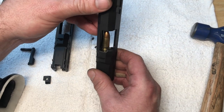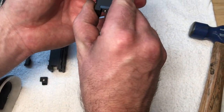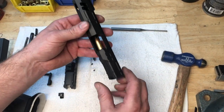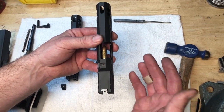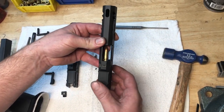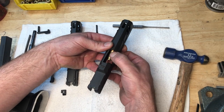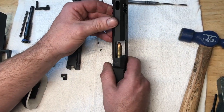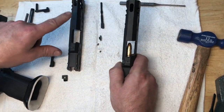I'm going to hold it directly in the center, where it's going to be lined up with the firing pin hole. Remember this case is going to go in the gun, come up into the barrel, be fired, and then we need the extractor to yank the case out. The extractors have a little hook on them and they're going to pull on the case. The tension left and right needs to be correct. There's a window where it operates — if you're too tight, when the case comes up from the mag, it'll pinch it. You'll actually see the bullet kind of tip up and stovepipe up into the top of the barrel. So that's too tight. If it's too loose, you'll slide this up on the test and it'll fall right out. The test matters a little bit depending on which extractor style you have — on the older ones I need a little bit less tension than on the new ones.